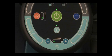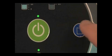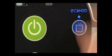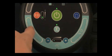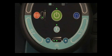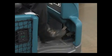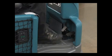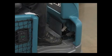When the one-step button is pressed to start scrubbing again, the machine returns to those settings. The scrub mode button controls optional scrubbing solution systems, including the extended scrub system, or ES, foam scrubbing technology, or FAST, and electrically converted water, or ECH2O. With this button inactive, the machine operates in conventional mode. On the lower left and lower right portions of the control module are buttons that turn the water flow on and off. When approaching a turn while scrubbing, the solution flow should be turned off and then back on again when exiting the turn. The machine's propel speed is controlled by a foot pedal. Press down on the pedal to increase propel speed and release the pedal to decrease speed. The brake pedal slows and stops the machine. Depress the brake pedal to stop the machine. When the machine comes to a stop, the parking brake automatically turns on. When you press the propel pedal again, it releases.